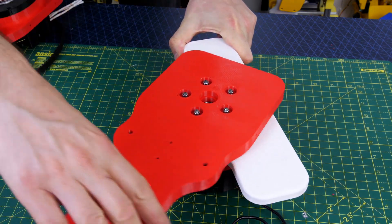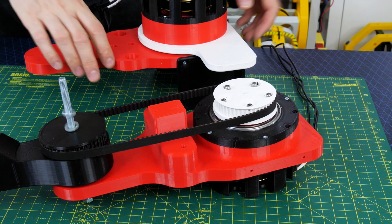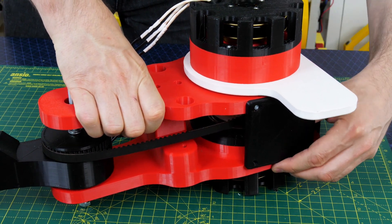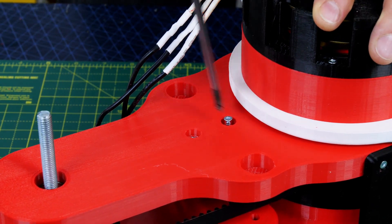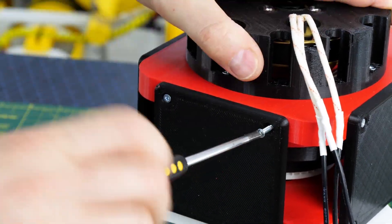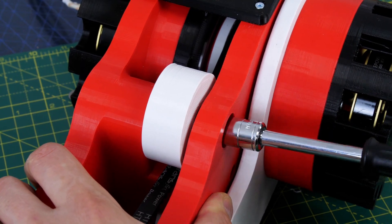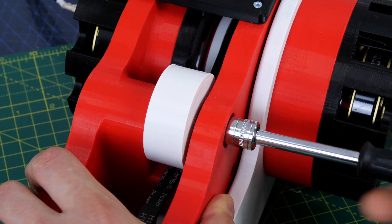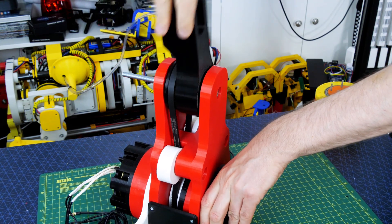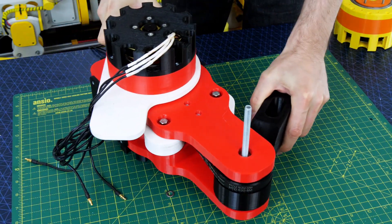The original motor with the T-shaped top plate is going to be our shoulder joint, so that's bolted to a piece with the same profile as the upper leg. Two screws go through that profile piece into a block printed into the lower assembly. There are also three plates on the sides and the top which keep the spacing where the motor is. I've made two idlers which have 6mm internal diameter bearings, attached either side with two 6mm bolts to tension that belt up. So now we've got a knee that moves pretty freely and can back drive its drive and the motor, and we also have the shoulder joint — both of those move independently, back driving both motor assemblies in the leg.